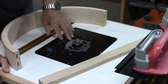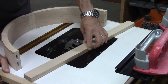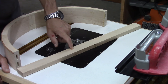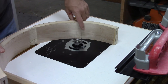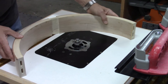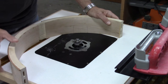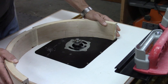I'm over here at the router table, and I've got a quarter-inch slot cutting bit set up. The height of the cutter is about the same height as this piece of maple stock — this is what I'm going to be using to make the buttons out of to attach the tabletop. I've marked out some starting and stopping points on the top of the rail. Very important to do this on the top of the rail — I almost did it on the bottom, put the marks on the wrong side. I had to erase them and do it over again. And I'm just going to start hogging out that material in there.